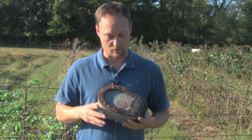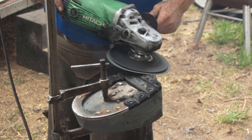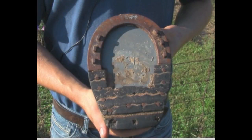The combinations on the bottom — we use either a full steel shoe, full rubber which is an implement tire, typically just a non-biased tread rubber tire that we put on the bottom that's lighter, or a combination of the two, like we have here: a half shoe and rubber.